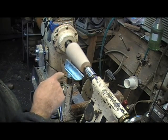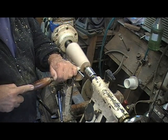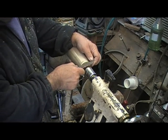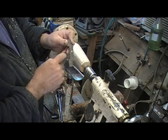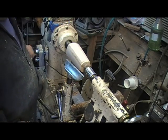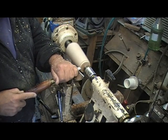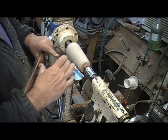I'm going to take my skew and put a foot on it — a tenon. Right here, this is my tenon gauge. It's magnetic and it sticks to everything, but it's my tenon gauge — it will let me know the perfect size of the tenon to fit in my One-Way Stronghold chuck. I can't make these gauges for you; you need to make them. I have some videos on it — they're very simple. I use my skew because I like that little dovetail.